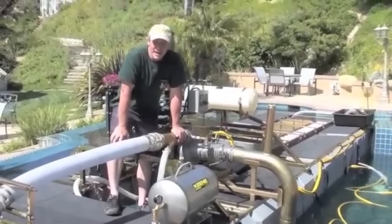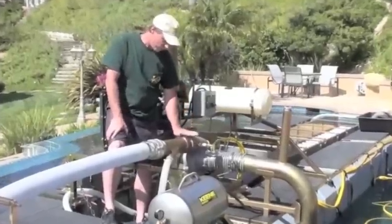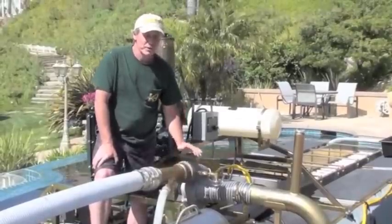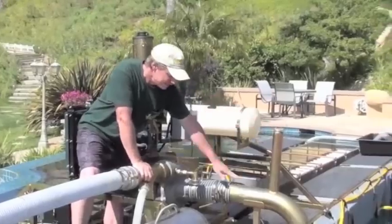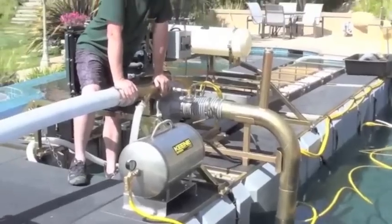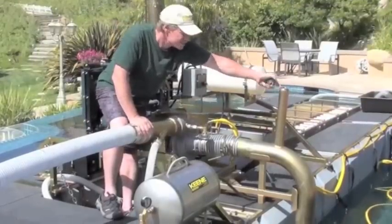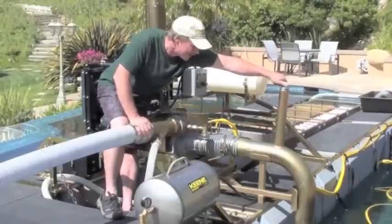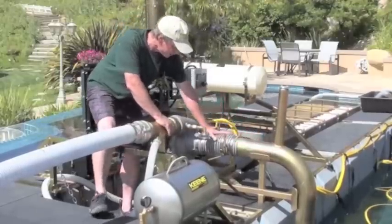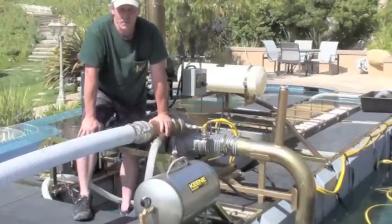I'm going to go through the basics of how the dredge works. Before you ever start the engine, you have to have the pump completely filled with water up to the proper level — otherwise you'll eventually do damage to the pump seals. Always run the pump in a wet condition. This is your pump intake. On the end is a foot valve, or check valve — a one-way valve on the bottom. So when you shut the engine off, you should be able to maintain a prime. Once you prime it that one time, fill it with water from a bucket until it overflows, put your cap back on, and start your engine. The pump is producing somewhere around 1,000 gallons a minute at about 40 to 50 PSI — you're really getting a lot of power out of this.